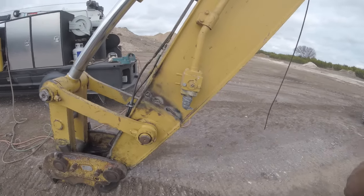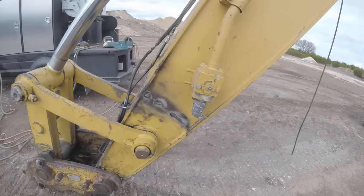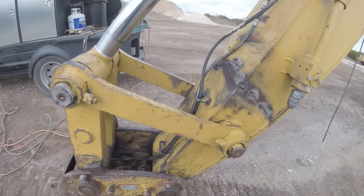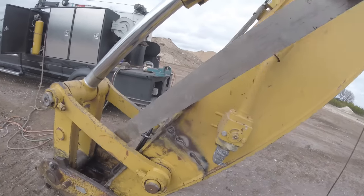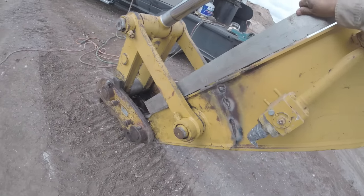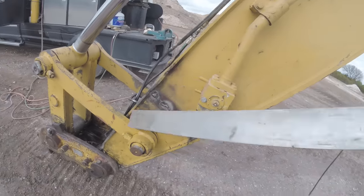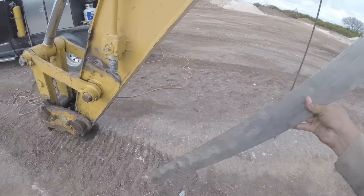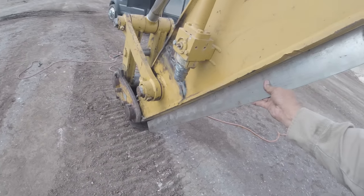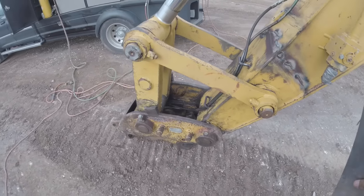Well, another correction. Being that it closed up, it looked like it was all nice and good, but actually this thing was bent. And maybe that's why those stops had to be put on down there. That boom is not parallel. So, see a big old gap in there. This way, up into here. That's way off. Same thing with under here. See that? That could be a big part of the problem with what was going on. With this not sitting right. This guy right here, at least.